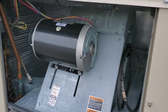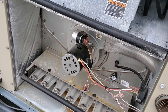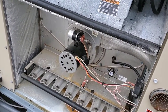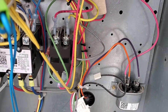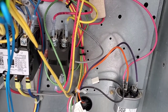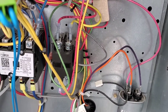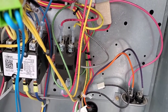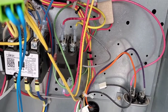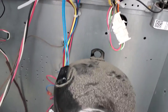Initially when I came here the inducer motor was running. I then checked the blower fan motor contactor and checked across the windings — the wiring was good. I was getting proper resistance on all three wires. It's a three-phase motor, and I also checked all phases to ground — perfect, no problem.